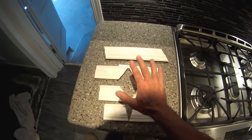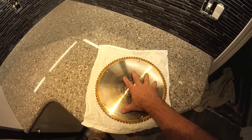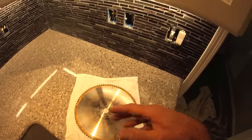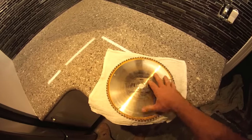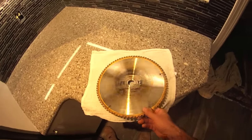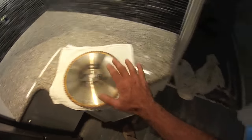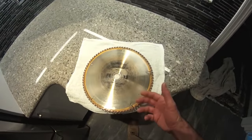I should have made the cheat sheet from the get-go. Mistake number two: the blade. I'm thinking step number two is you always start crown molding with a sharp blade. This is an 88-tooth, 12-inch DeWalt blade made for fine cutting. When it was new it was fantastic, but the problem I was having — and I didn't realize it because I'm stubborn — is that making these deep cuts at a steep angle against the grain, the blade would get hot, it would wander, and my angles were not accurate. You can see where it's burned.